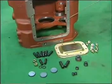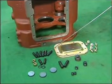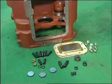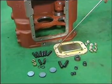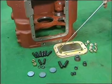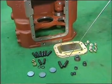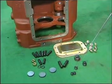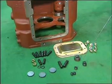It consists of the 18686 transmission housing, six double head bolts, cover for bottom PTO window, gasket for cover of bottom PTO window, eight bolts, two double head bolts, spring gasket, two nuts, three round magnets, two locating pins, flat bottom bolt, square groove comb plug, screw plug for monitoring oil surface, and oil exporting plug.